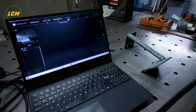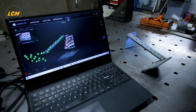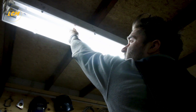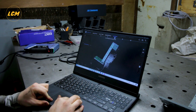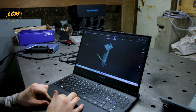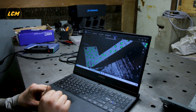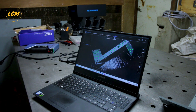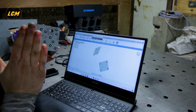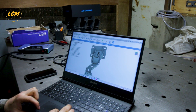I've taken out one of my LED lights so hopefully the lighting is dim and off. And in a matter of minutes — or actually seconds — we have a 3D scan. This one isn't pretty because the lights are turned on; with the lights turned off it's way more accurate. We can see exactly where the holes need to be, and here the exact same thing for the engine. With this file I can open another program, take these measurements and put them into a CAD file. The most important thing is where it is located in space, and with that 3D scan I know exactly where everything needs to go. And you can start drawing.